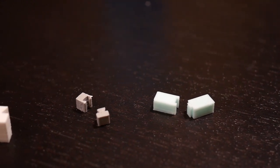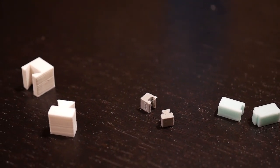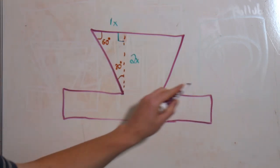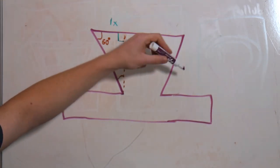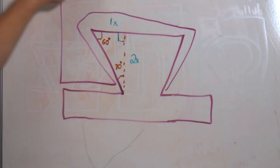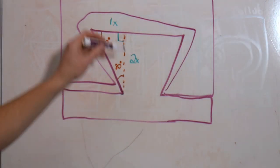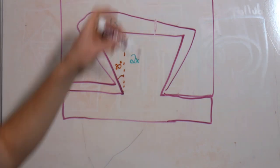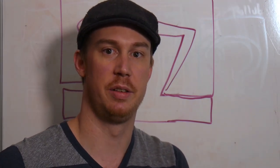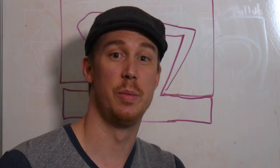I think I went through about 5 designs before I finally found one that I liked. Some things I needed to consider were how much clearance do I want between this rail and the notch that's cut out for the part that fits down onto it. If that's too tight, they'll just bind together and they won't slide past each other, too loose and the whole case will be wobbly.